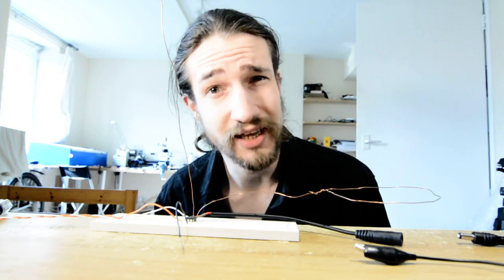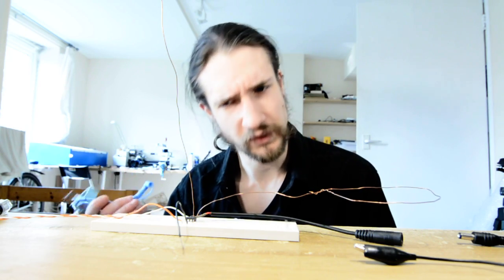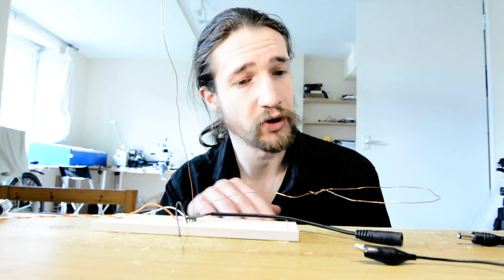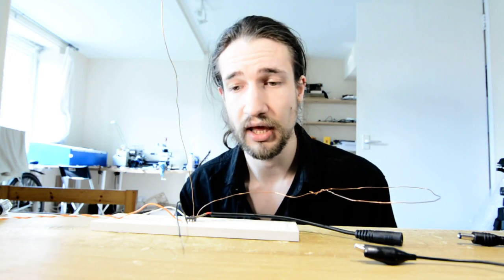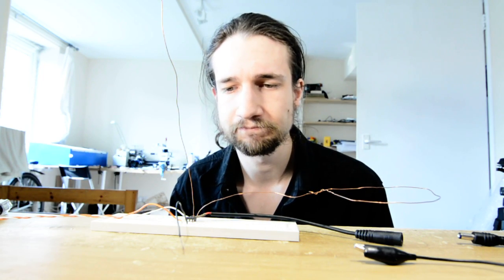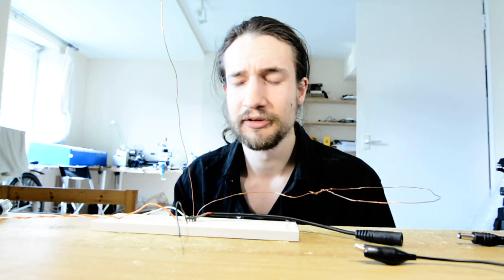When I connect the wrist strap, the best place to connect it is PB2, which is the pin that's going up and down. This suggests maybe it was sending a square wave through my body that was being transmitted to the antenna via RF. But it still works without the wrist strap and with that pin connected to mains ground. In that situation the power supply is floating and isolated, and the whole chip floats up and down with each reading. So I don't know if it's the relative capacitance of the circuit, or maybe it's transmitting RF that's being variably absorbed by me.